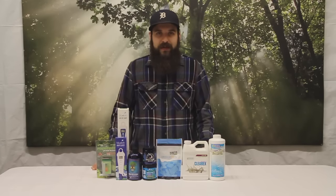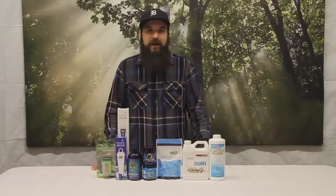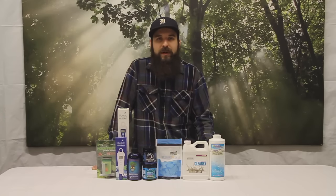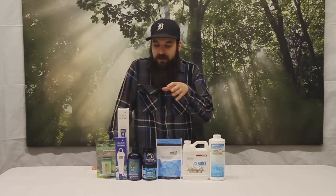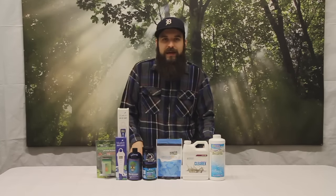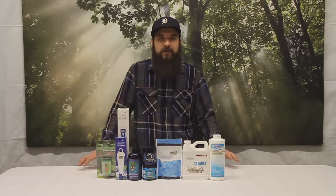That's just going to require you going down there and taking a sample every couple of days, or at least once a day ideally. I would recommend using some kind of plastic container — not glass preferably — scooping some of that water out of your reservoir and testing it with your pen. It makes it easier on you and you get a better, more accurate measurement.